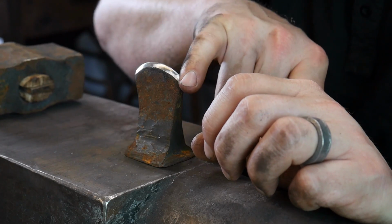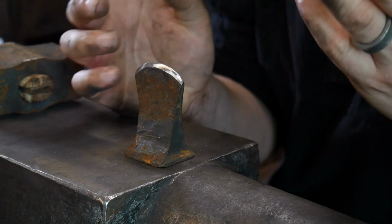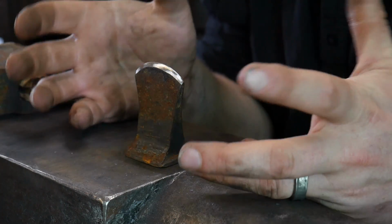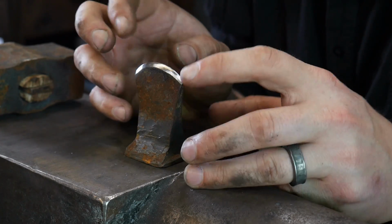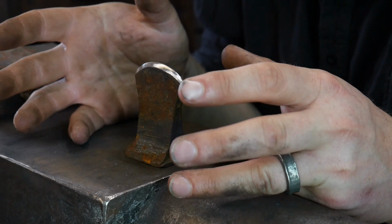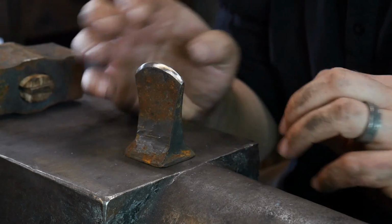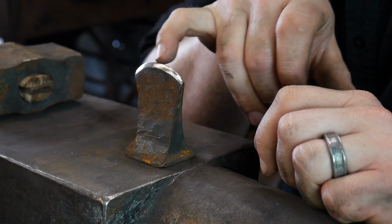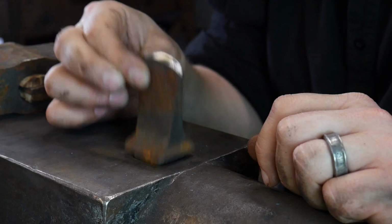If you have a 1/16 inch flat, it is a lot less prone to actually doing this. The cut is basically the same. It'll leave just a little bit extra rag than what maybe cutting perfectly to center would be, but who here is perfect? Not I and not you either. So that's kind of irrelevant. But that little bit of a flat there really does stop you from having to dress your tool so much.